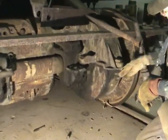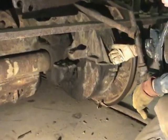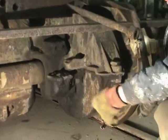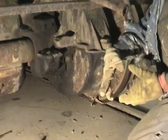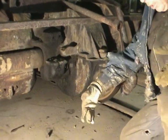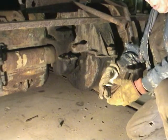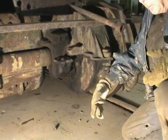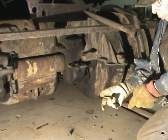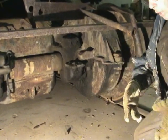Right here is a big spur gear, just a plain old ordinary gear, and on the end of the armature — which is the part of the motor that turns around — is a small pinion. So you have a small pinion driving a large gear. That means the motor turns faster than the wheel because you're getting a reduction. This has to go around probably four times for every time the wheel turns around.